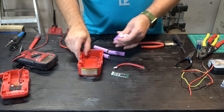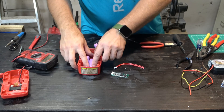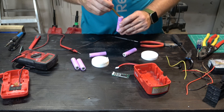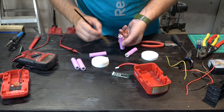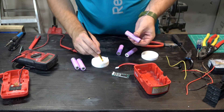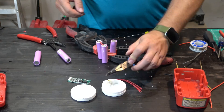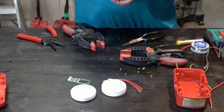Now back to making it. I'm only doing five single 1,800 milliamp hour batteries in series because that's all I could fit with the tabs in my battery casing. When soldering leads onto 18650 batteries, you want to minimize the amount of time the heat is applied to the battery, because too much heat can possibly explode it. I'm putting a little flux here so the solder takes to the terminal faster. I also pre-fluxed the connector wires and pre-soldered them so I didn't have to hold the iron on the battery for long.